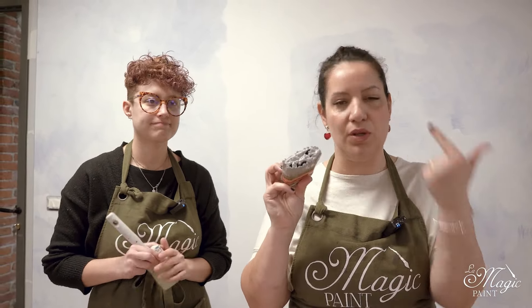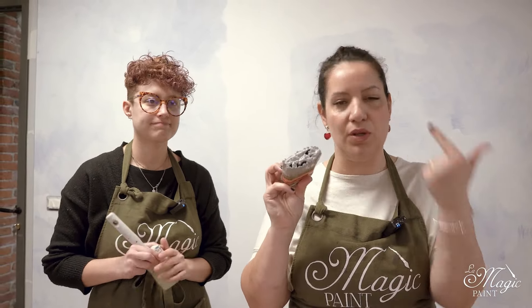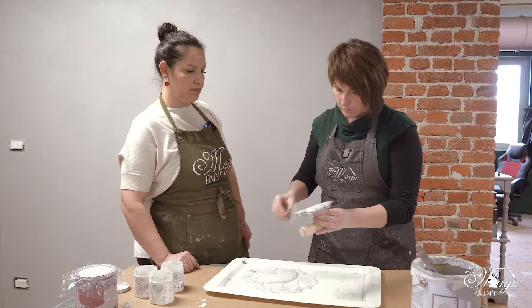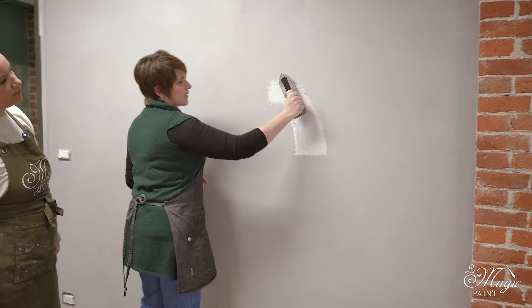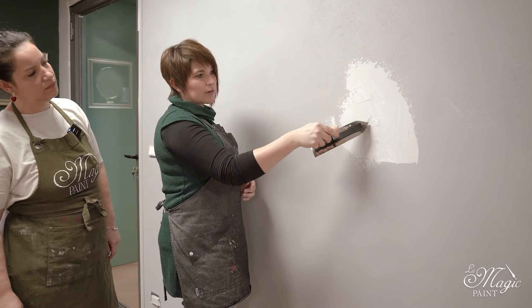We often go a bit by eye. Let's go ahead and add just a little bit of Julia's gray to ensure we don't have a completely white wall, which would be out of place. The tone is actually very, very contemporary. Let's also note that it lightens a bit as it dries. We take a spatula, put it on the spatula, and start spreading it unevenly, leaving some portions exposed, and then we pull it until the putty is worn away — like this.